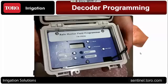It doesn't matter. What I'm going to do first is hit the read button. When I hit the read button, the address is going to pop up in that small LCD. Now, when it appears, if I want to change it to be something else, so let's say that I read it, it comes up and it says that it's decoder 001, and I want that to be 005. I'm going to use the plus sign button, the one at the top, to advance it to 005, and then I take the button right below read and I hit program.